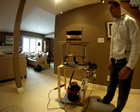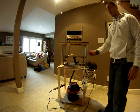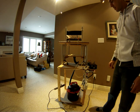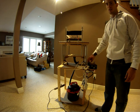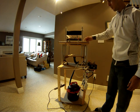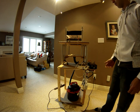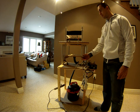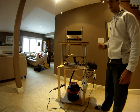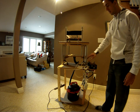You'll also notice the platform is moving a little bit slow right now, and that's because I actually bought the wrong stepper driver. I thought this driver would do single steps but it does not — it only does micro-stepping, so I'm actually stepping at quarter speed right now. I've ordered a different one that does single steps, and when that comes in the machine will move four times as fast. You'll see the mold platform really drive itself up into the mold without giving the plastic a lot of time to cool, because obviously having it cool before it touches the mold would be a bad thing.